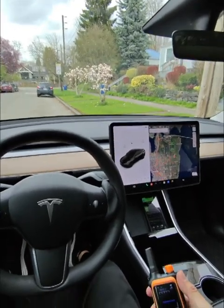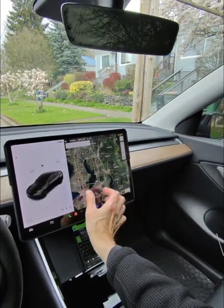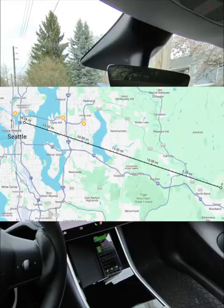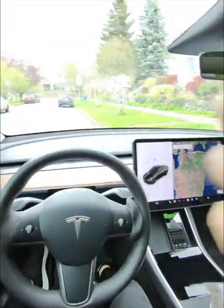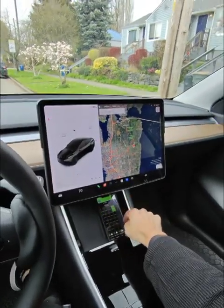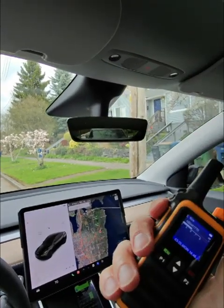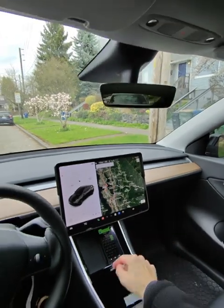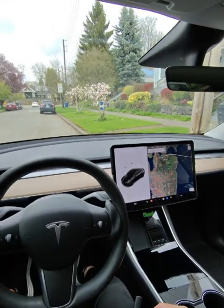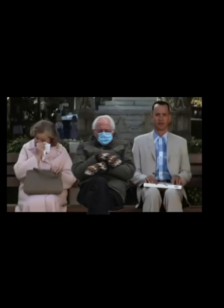Now I'm down in the Madison Valley — a valley in Seattle. North Bend is way out there. KG7APU signal check. I'm still hitting it. Let's try UHF, North Bend, same place. KG7APU signal check. Holy smokes — yeah buddy. Lots of hills and stuff in the way, but it's got a nice punch. I did test the SWR on that antenna and it's 1.2 — it's fantastic.